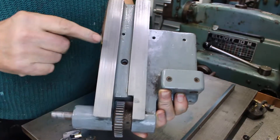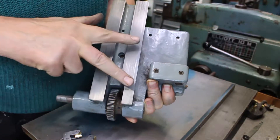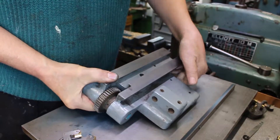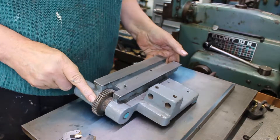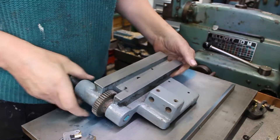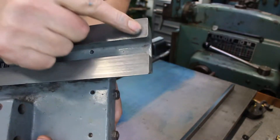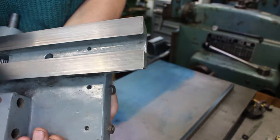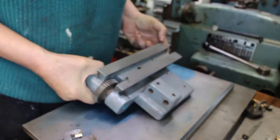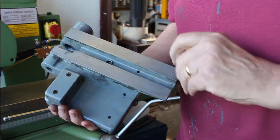You can probably see there is a bit of blue along there, so it's touching probably half the width, off centre. So what I think I will do is see if I can surface grind that flat. You can actually see an awful lot of wear at this end, and the surface finish is very rough — perhaps a lack of lubrication, I don't know. But it definitely needs a lot of improvement. So I've decided to surface grind the top surface of the y-axis.